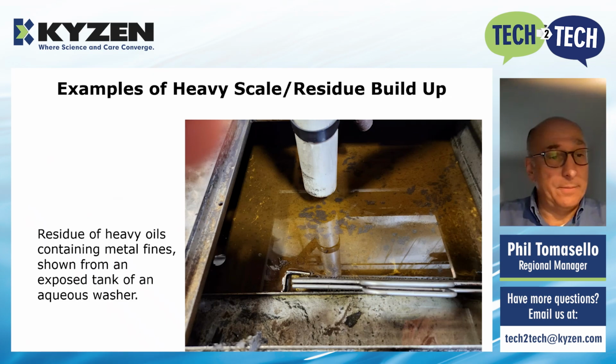Perfect example here. If you take a lid off of an exposed tank in an aqueous washer, you can find lots of fines, metal chips that are sitting here in these soils, right? The residues and oils that are there. So keep in mind, do you have an oil skimmer running? Do you have a coalescer running? In many cases, that may not be running. That's going to add to that problem.